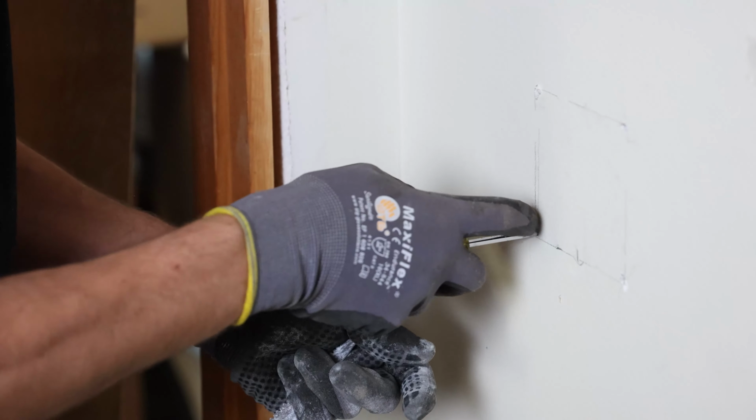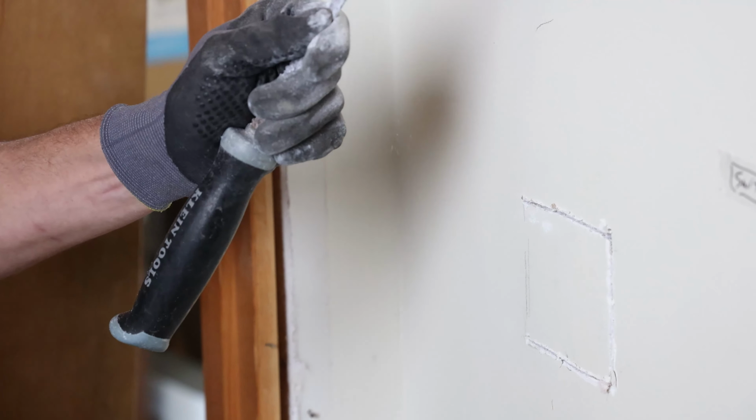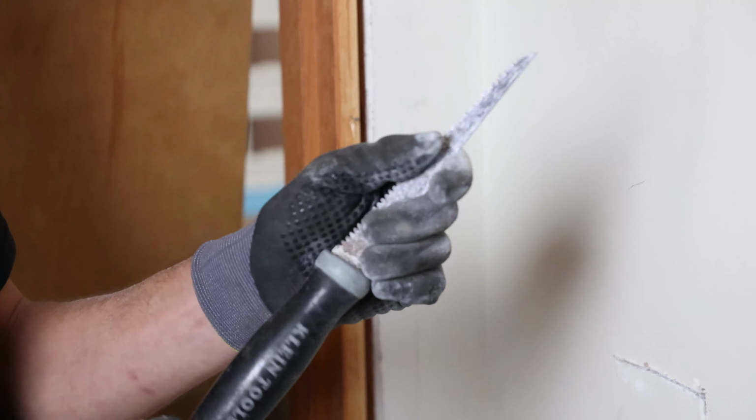I was confirming the depth in contrast to my box. We're in great shape. I actually hold my blade at the depth of the cut that I need so that I have comfortable action. If you have a brand new razor sharp saw, I've actually had apprentices that have punched through this side of the wall and the other side of the wall. And now we're paying for a patch job and a paint job, $250 in, no bueno. So literally I'm grabbing the blade on purpose, and that's just limiting the cut.